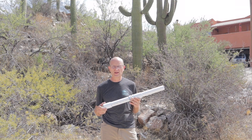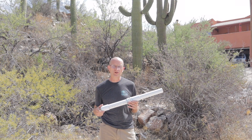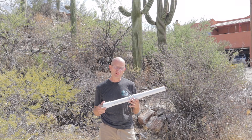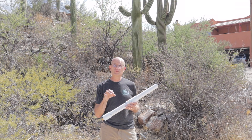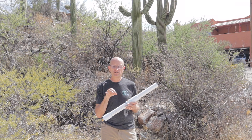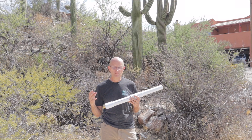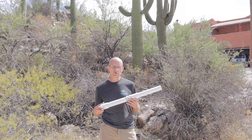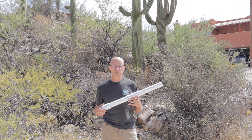I tried the same design as the small foam generator wand but it just didn't work. The single hole output on the front — to get the flow I needed I had to go up to three quarter inch and one inch, and the stainless pot scrubbers kept wanting to blow out the front. So I had to come up with a new design, and that's what this one shows.